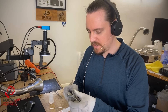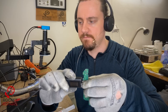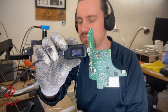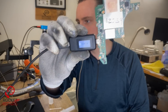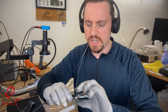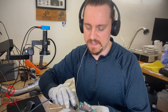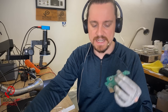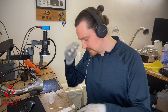Trying this without the chassis or anything - just want to see if we get anything on the ammeter. There we go - it says 15 volts. We're not drawing any amps, but that's because we don't have the battery in. I'll try the other side as well - there we go, it pops up, exactly the same, no amp draw. On a normal Nintendo Switch, it usually goes up to around 30 milliamps then drops down even when there's no battery connected, but this isn't doing it. But it's an OLED, so it could be the slightest change that makes a difference.